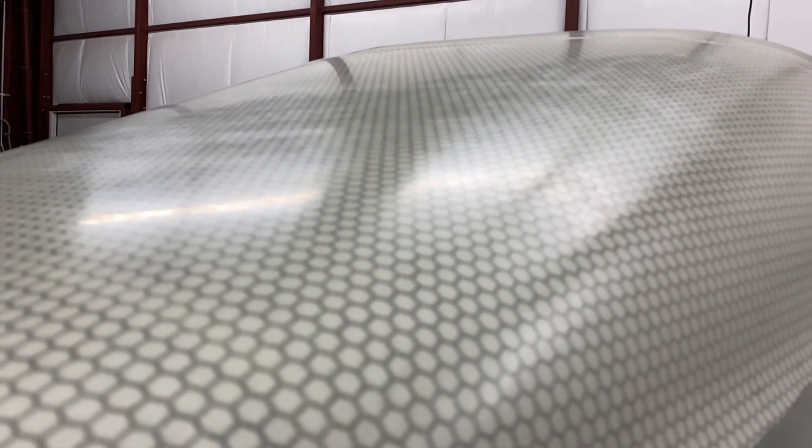That's all the carbon fiber types we use in the airframe. Let's check out the fiberglass types now. We don't use a lot of fiberglass in the Dark Arrow 1 airframe, but there is some. The canopy fairing on top of the fuselage is made out of fiberglass. We selected fiberglass there because we want to house a number of the aircraft's antennas in the canopy fairing — fiberglass is transparent to radio waves, so the antennas can see out. Keeping the antennas internal is also good for aerodynamics since they're not hanging out in the breeze causing excess drag. The canopy fairing has compound curves, so we selected this 2x2 twill weave for its drapeable and conformable manufacturing properties.